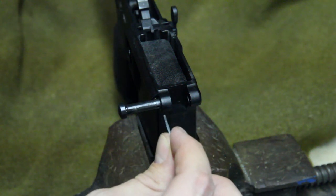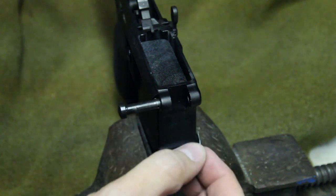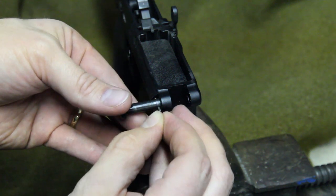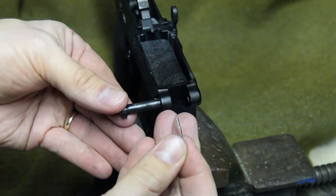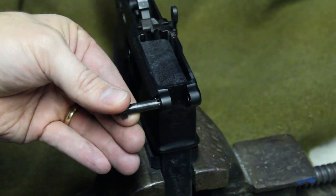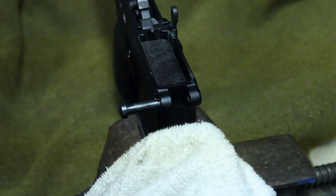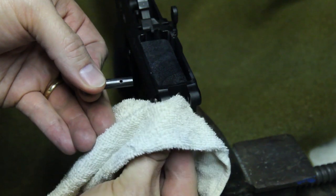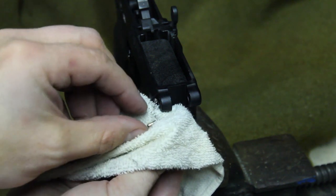My 1/16 pin is a little too narrow to fit in the hole to push back the detent, so I'm going to use a staple bent out straight. Nice and easy — you just push it through all the way, then rotate it. As you can see, the hole is now facing up so the pin is no longer being retained. Then just take a shop cloth, hold it over, pull the pin out, and you can see the detent came out in one nice easy piece.